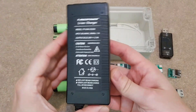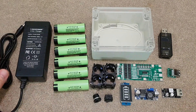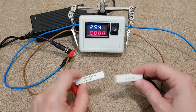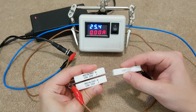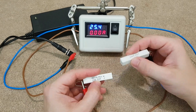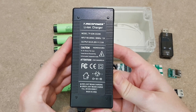I will add a few pieces of strong double-sided foam tape to the BMS board and battery pack and stick them to the power bank case later. To charge the battery I got this 2A charger. Usually these adapters are less powerful than their rated values, that's why I got the 2A unit instead of 1A. But let's test it. I will use my DIY voltmeter/ammeter to measure the output voltage and current. These ceramic resistors will represent the load. 1A at 25.1V, then 1.5A at 24.9V, and now 2A — the voltage dropped a bit to 24.7V, but it can really deliver 2A. This charger is very good.